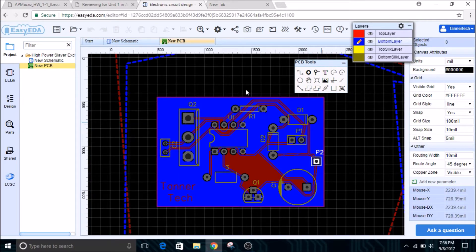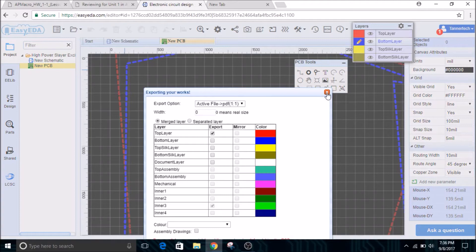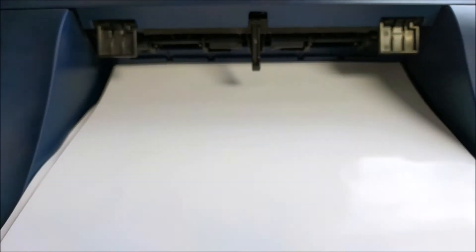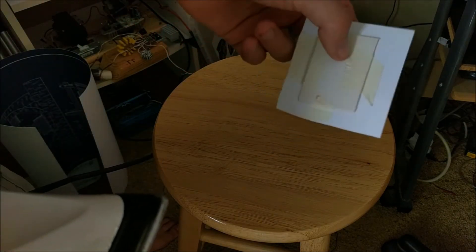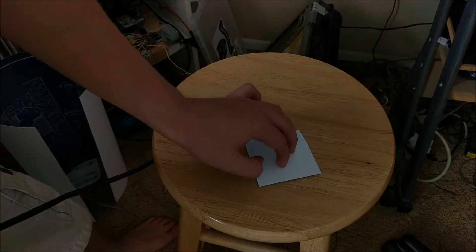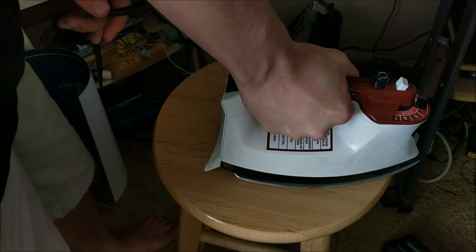You can either take this PCB and directly import it into EasyEDA's circuit board building service, which will have them design your circuit board and mail it to you. But if you don't want to do that, you can go to Export and save it as a PDF file, which you can directly print using a toner printer onto a piece of paper. So now after you have your circuit board printed out on a piece of photo paper and your piece of copper clad board cut out and taped to it, you're ready for the next step.